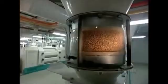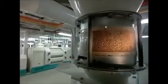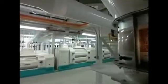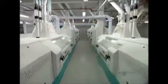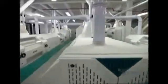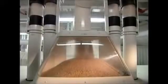This mill's vertical production line is 5 stories high. Gravity carries the wheat downward through a succession of milling machines. Each one grinds the grain between steel rollers, then sifts it. Particles too large to pass through a sieve continue downward into the next milling machine, and so on. By the last machine, whatever's still not fully processed gets vacuumed up to the top to begin the cycle again.